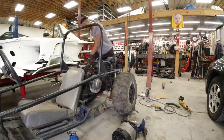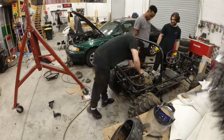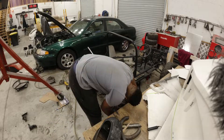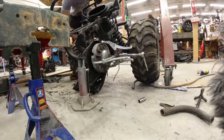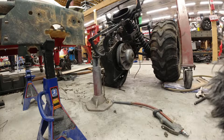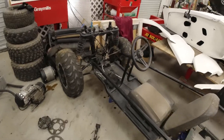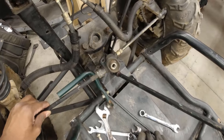I need to make sure I cross all the T's and dot all the I's to ensure this thing is going to be safe to operate. I'm going to begin to remove all the excess metal so that I can shorten the wheelbase, because in part one the wheelbase was over 80 inches, which is absolutely unacceptable for a vehicle of this performance. Removing the excess metal will give me much more room to sandwich the ATV frame farther inside the go-kart frame, shortening the overall wheelbase and increasing stability. I also need to leave room to mount the dual motors. Let's get started.